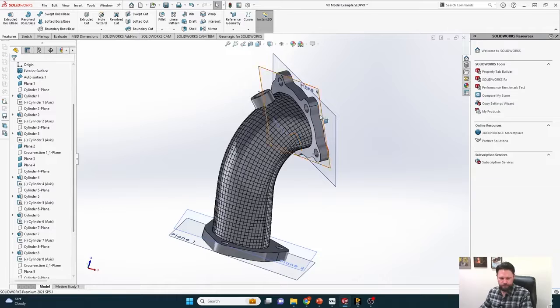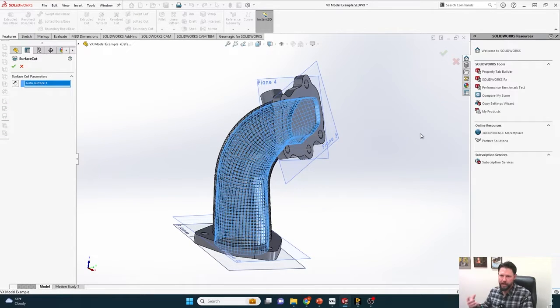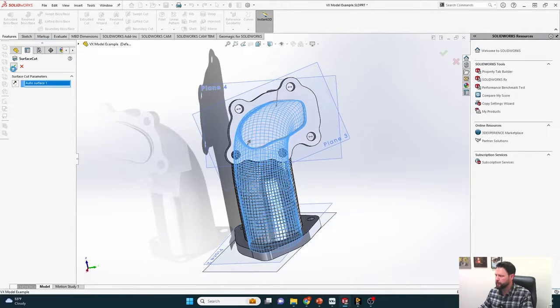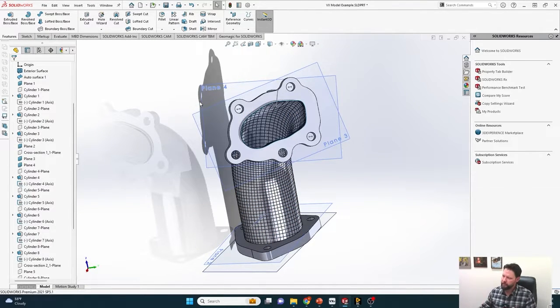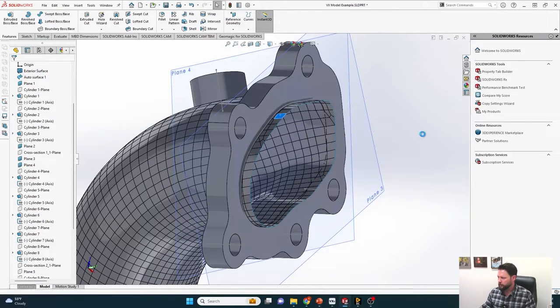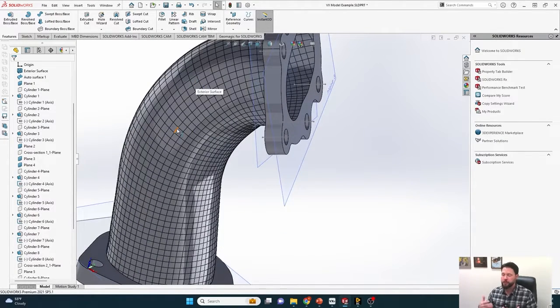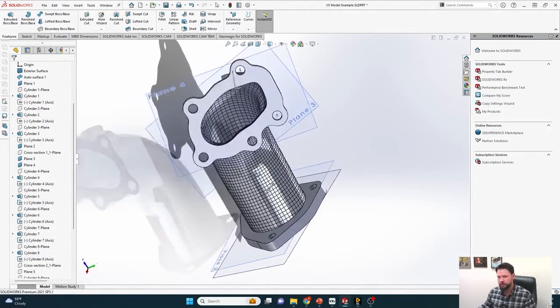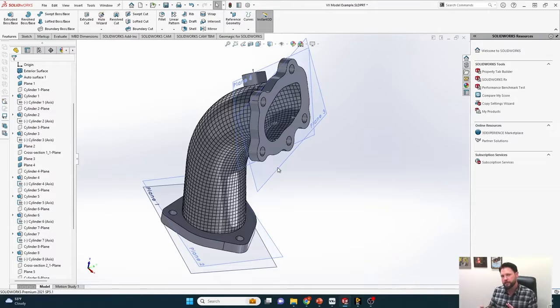For the inner surface, we can't use Combine since it's a surface - we'll handle that separately. For everything else we cut out with the Combine. Then the last step is Insert Cut with Surface. We've got one single body and one single surface, so we do an auto cut. That cuts the inside out and gives us the same results as we would in Design X. The main difference is these freeform surfaces are NURBS surfaces and we can't really edit them - we'd have to rebuild them using sections in SolidWorks. But for geometric features, it works awesome and is super fast.